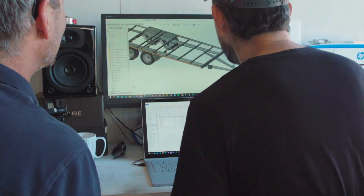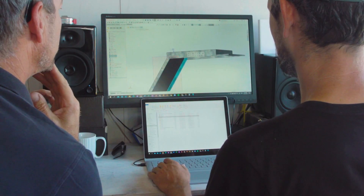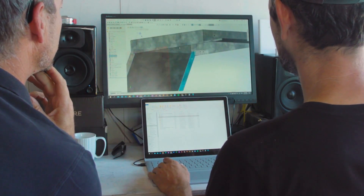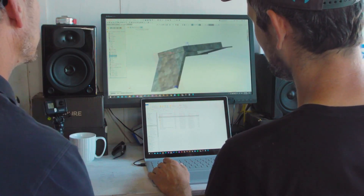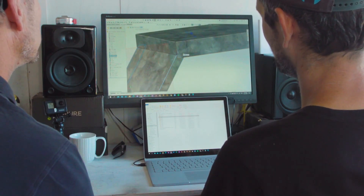So remember I changed some of this detail? I did a redo — it was getting all a bit too complicated. So I've done this thin sort of sheet metal, it'll be like pre-galved sheet metal. Once that 1.6 folds up it looks like a little bit of origami, but it'll turn up just like that and you're just about to bang some rivets through there.